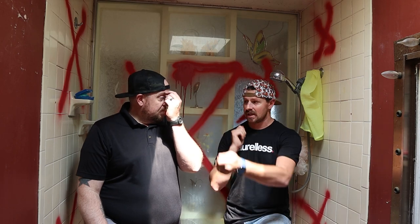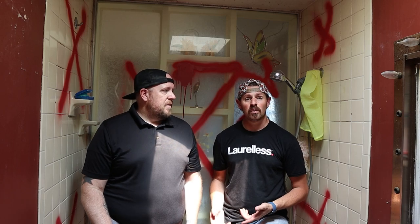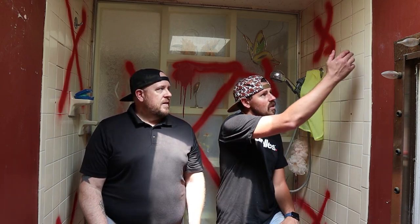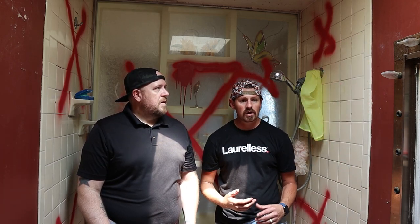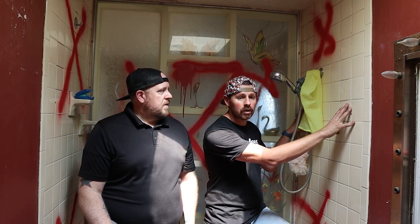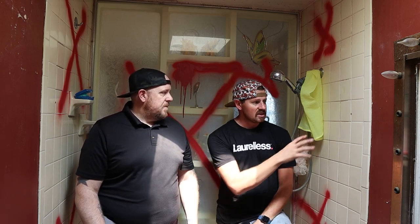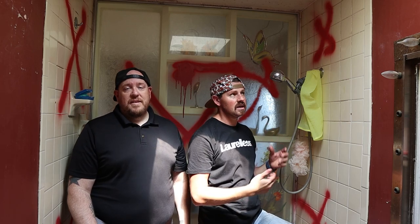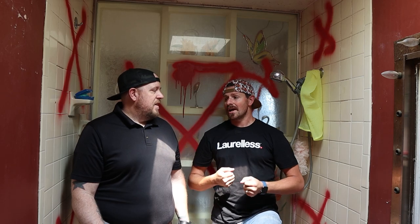The cast iron tub is in really good shape, so we're actually going to keep it in place and get it reglazed. One sneaky way I like to demo a shower — a lot of people come in with sledgehammers and start breaking and shattering tile, and it falls in the tub. Since we're trying to keep this tub, I don't want to damage it. We'll put a piece of plywood over the tub so anything falling won't damage the finish. Another thing I like to do: where the tile meets the wall, I score it with a multi-tool or utility blade multiple times and try to take the whole wall section out, backer included. With nails you can pry this little by little — the whole piece comes off in one big giant piece. No mess, no fuss.